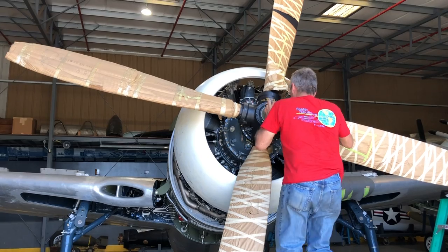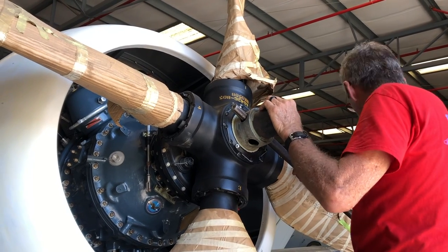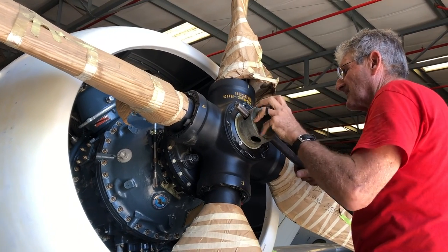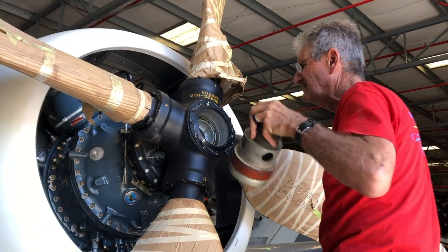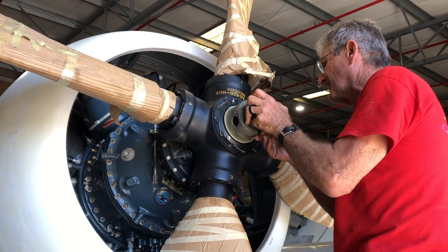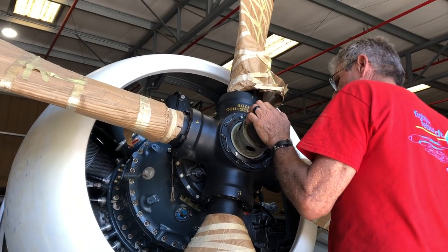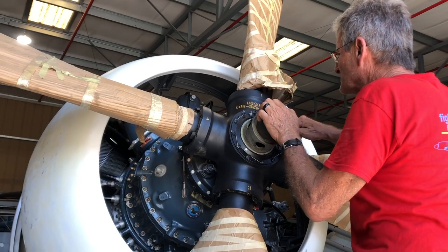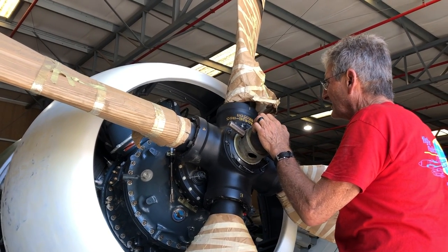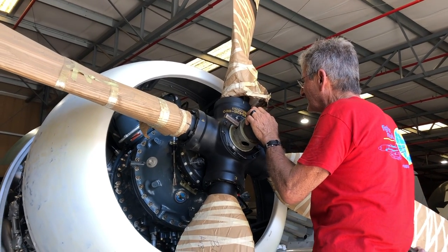What you see there is a splined wrench going in to torque the propeller. The spec calls for 1,000 foot-pounds, so we need either 200 pounds at the end of five feet, or 180 pounds at the end of five and a half feet. Kevin is the dead weight, so he's going to do the final hang on it to set the torque. Then the final last bit of adjustment is done just to line up a keyway so you can put a safety in — so the nut cannot come off.